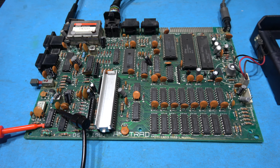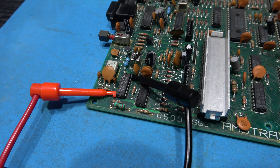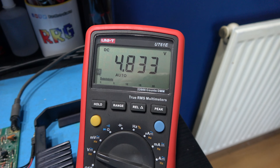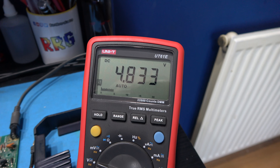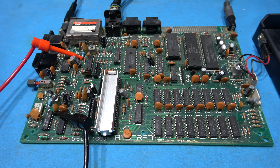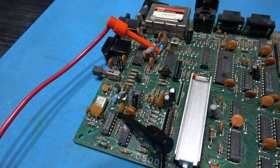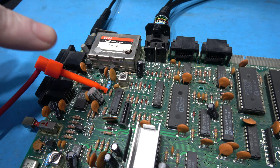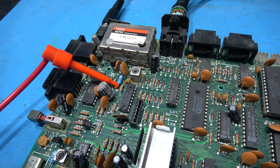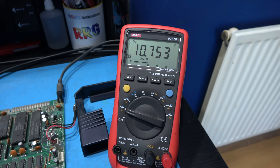The first thing I want to do is make sure this board is getting power properly. I've hooked up a positive and negative lead of my multimeter to a 74-series logic chip on the board, and as you can see, we're getting 5 volts — a little on the low side but still perfectly fine. I'd say the 5 volt rail is looking fine. Now I'm checking the 12 volt rail. My negative probe is still hooked up to the negative pin of the 74-series logic chip, and I'm hooked up to pin 11 of the TEA2000 video chip. That needs 12 volts, tapping into it at the bottom of the inductor. It's a bit on the low side, but that's perfectly fine.